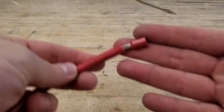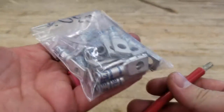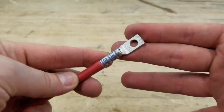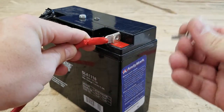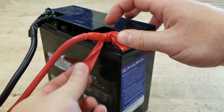Batteries are a different beast all on their own. These are the only part of your robot where you will find 6 gauge wire, and some teams go so far as to make their own 4 gauge wires. These connectors come in your kit parts and are available for purchase from AndyMark — the ends are already stripped for you, so just remove the cut insulation from the ends to get started. Here we need specifically the lugs from the kit or AndyMark. Insert the wires into the terminal, use those crimpers to get a good connection, perform the tug test, and then use electrical tape or heat shrink to insulate. Connect these terminals to the open terminals on the batteries using the provided nyloc nuts and bolts — tighten these down as much as possible and cover with electrical tape.